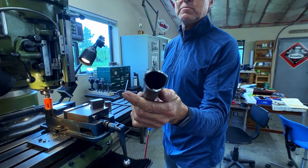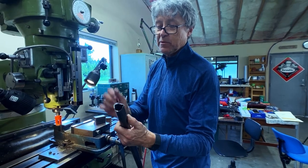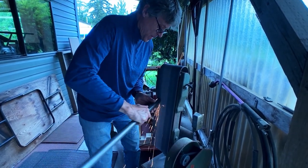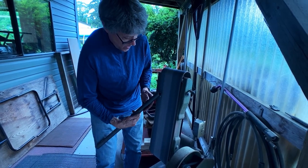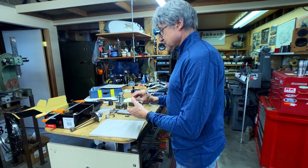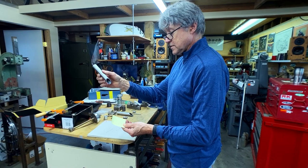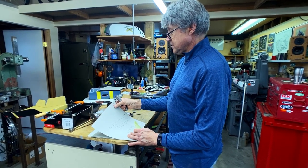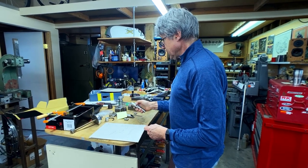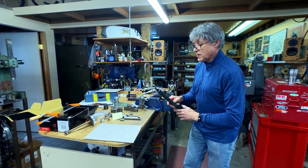So that's what it looks like when it's mitered. I need to go out to the belt sander, take off the burrs, sand it up a little bit. The stem we're making today is a seven-eighths quill, 130 millimeters long, and the rise is 20 degrees. So I'm going to use this sheet right here, and that's what's going to help me determine how long it's going to be.